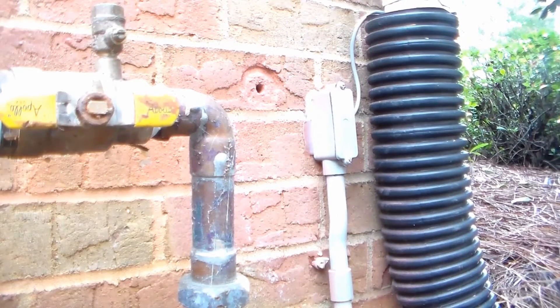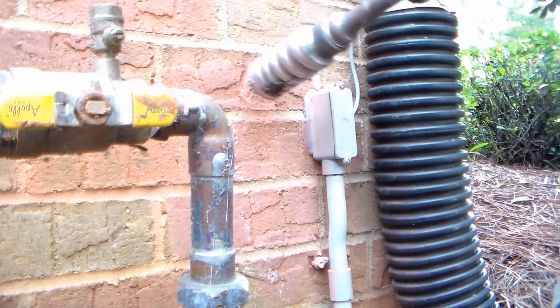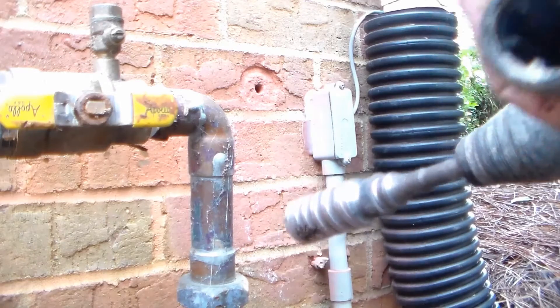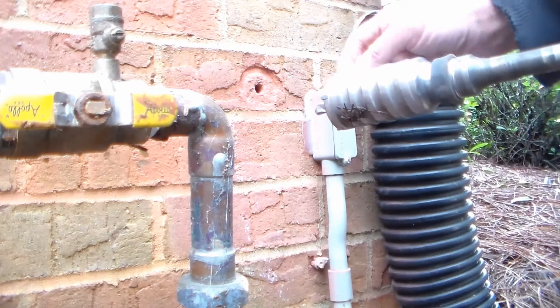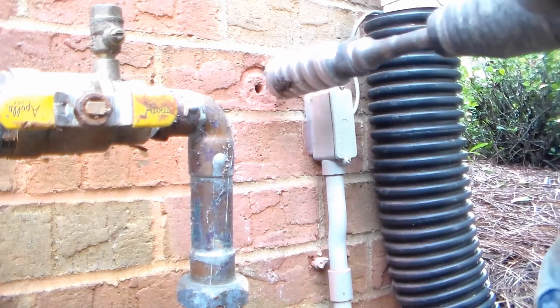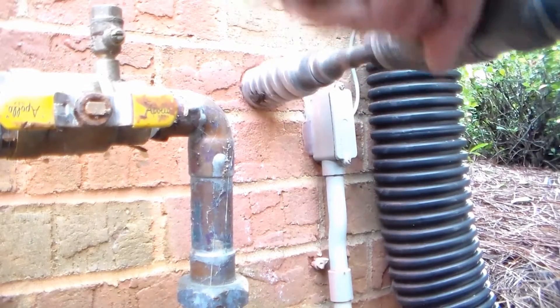While they finish the pit, we'll go ahead and core this wall. We use a Bosch hammer drill with a two-inch diamond core bit — industrial-grade diamonds. And of course we've just got a masonry bit that pilots it. Takes about five or ten minutes.